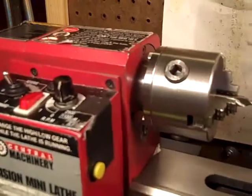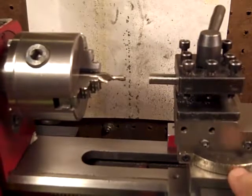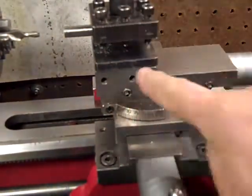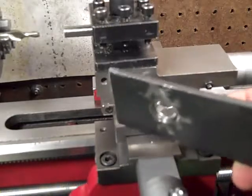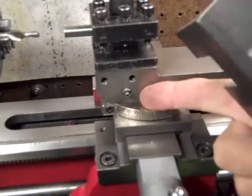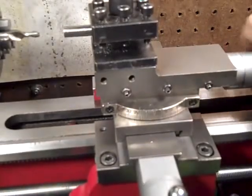I tried a lot of things. I wanted to set up like a milling device here with something with right angles — maybe a big chunk of angle iron or something. Now this angle iron fits on here. If I take this off, it fits on the two bolts that hold it on right under here. There are two nuts or cap screws. You unscrew this, this can be tilted — that's how these mini-lathes, the tilt on the cross slide works.